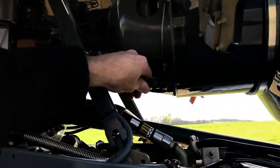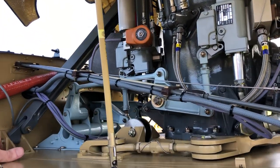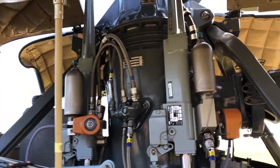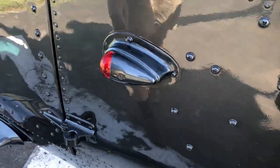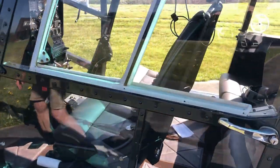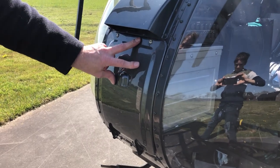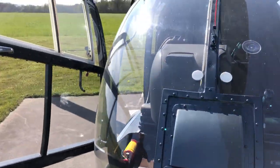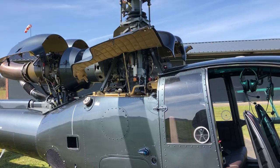Torque transmitter — secure. All components are secure. Check split pins, safety wiring, and eventually oil leaks. Check securing of the positioning lights. You closed the auxiliary power door. We got back to the front of the helicopter. You closed the fuel battery access door and removed the pitot cover. That's it for the SA341 pre-flight inspection.